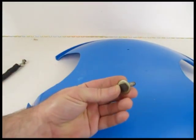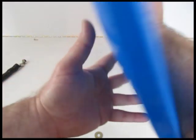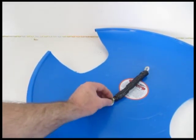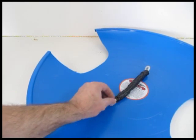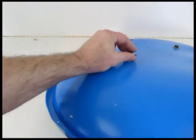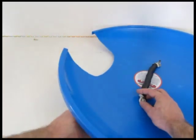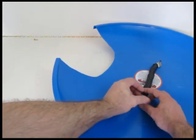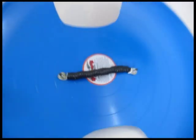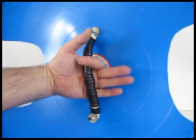Use two short bolts and nuts and four washers — a washer against every side. See how I have a washer on the outside? When I put the handle on, I'll put another washer on it; this will prevent it from sliding off. Then I'll put a nut on it and lock it down tight. Do the same thing on the other side — pass a bolt through it, put it through the handle, put a washer and a nut, and lock it down tight. Now we have our handle to hold the shield with.